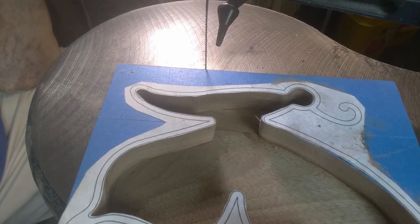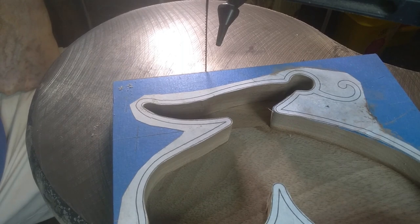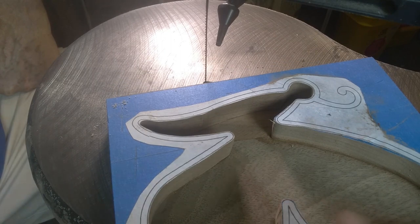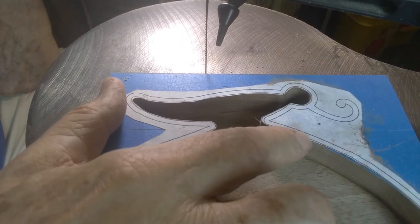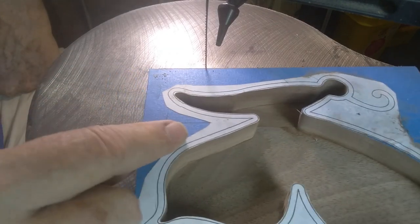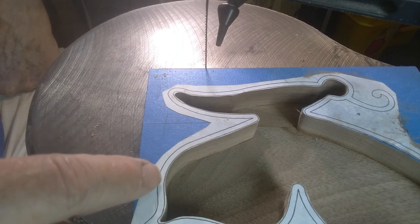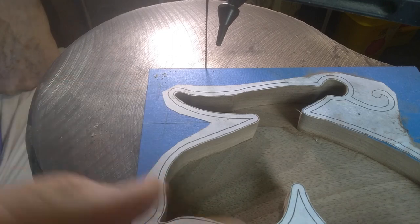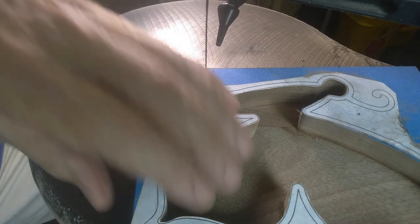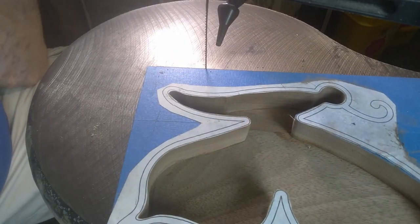Okay, I've had to make a change in the body of the box. I was using that inch and a quarter poplar with a walnut quarter inch base, and was cutting that with a number 7 blade, and it was really not tracking very well. And as I got halfway through, the blade was really beginning to get dull, and it started really getting out of whack, and it was cutting through the wall in the center. The blade was bowing, trying to make those hard turns, especially when it was dull. So I've gone to a 3/4 inch walnut with a quarter inch walnut base, and I've gone to a larger blade.